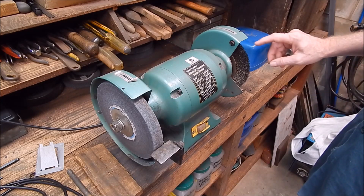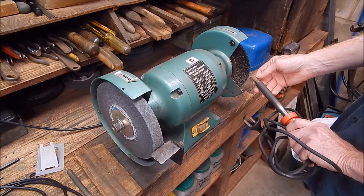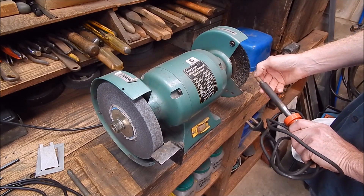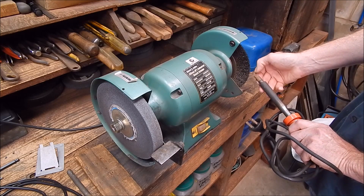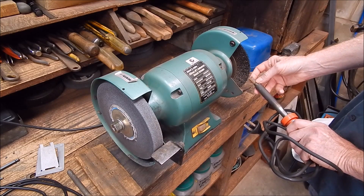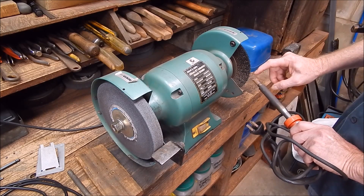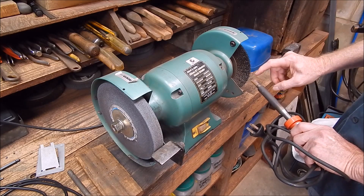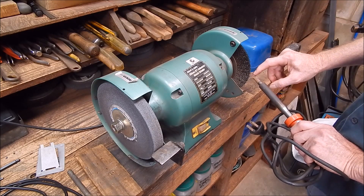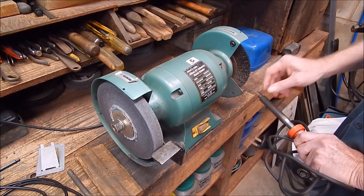The first thing people do wrong is use one of these wire buffers to clean the oxide off and get it shiny. It's shiny alright, but it also leaves a very smooth surface that your tin will have a lot of trouble adhering to. It polishes it rather than cuts it back. What you want to do is cut it back to the original surface without any polishing. So you don't do this — I'll use it on one side to show you the effect.